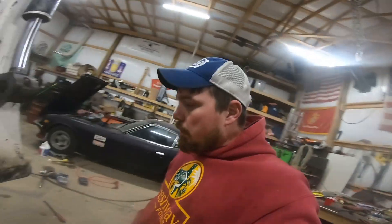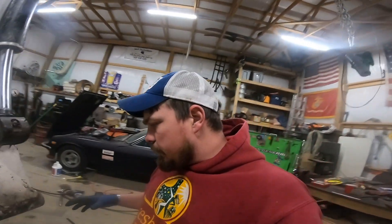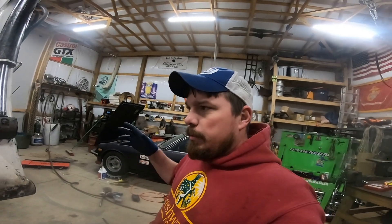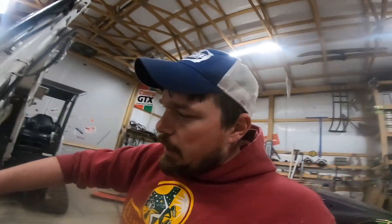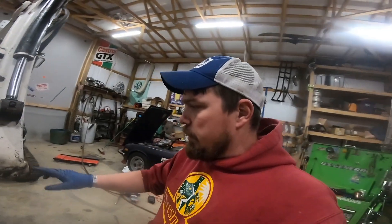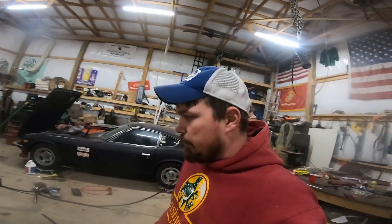That worked. I'm going to wait to put the oil seals in — I'm not sure which way they go. I think it's cup towards grease, flat towards dirt, but I could be wrong. I'm going to try to get one of these out in good shape and take a look at it. This thing is still pretty warm, and those bushings are real cold, so they just slid right in. That was beautiful.